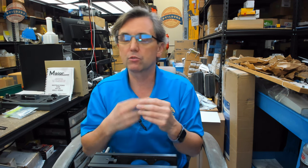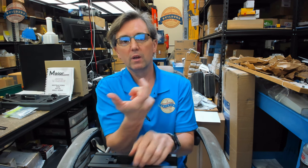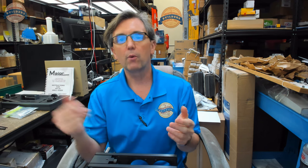woodworking clients of ours, generally large ones, that are doing projects for very high-end retail. If it's high-end retail, I've supplied material to it, whether it be shoes or purses or watches or cars, anything. You're going to very commonly have a typical door thickness, 1 3/4 inch, but then they've added 1 inch of high-end woodwork on one side. So now we've got a 2 3/4 inch thick door, but what we really have is a 1 3/4 inch thick door with a 1 inch panel applied. But obviously your center line needs to be adjusted for that when you're prepping.